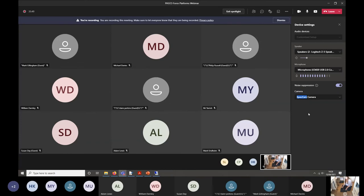So this is what the plate looks like — about 37 by 37 centimetres and comes off the ground about 7 centimetres. It's a PASPORT sensor so it comes with that particular plug, and we need an interface to connect it. In terms of load, this can measure 4,400 Newtons in the upward and downward direction. It can also measure lateral force in one direction via a rolling plate on top, which does introduce a slight instability — so if someone is jumping quite high on it, you want them to be careful.